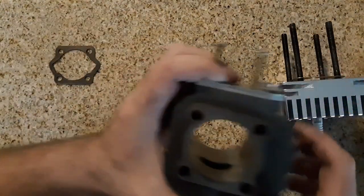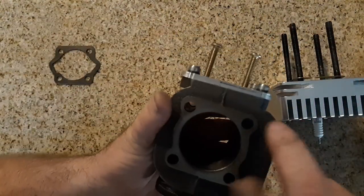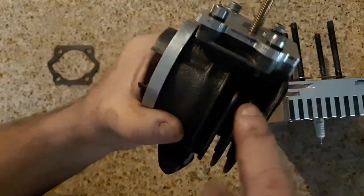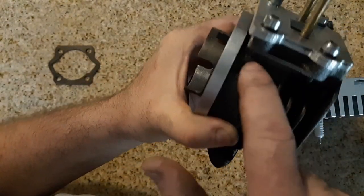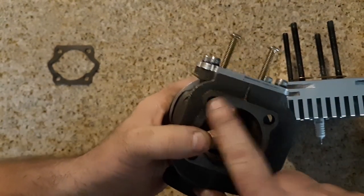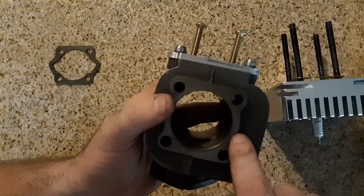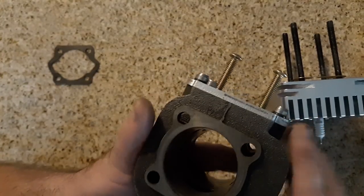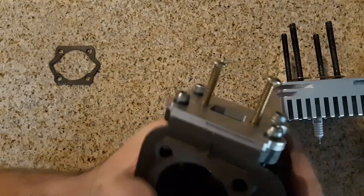When you get one, you're going to need a drill press. You have to drill through in this section, right through — eight millimeter. You actually need like a nine millimeter drill bit, one size bigger. I would not go past ten millimeter, otherwise you're getting close to some stuff.